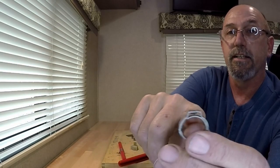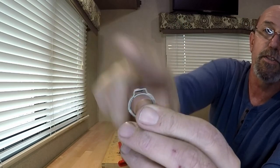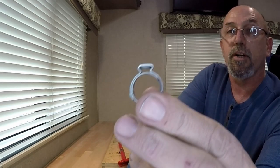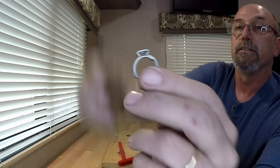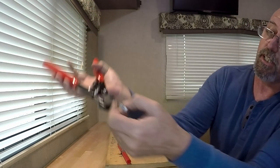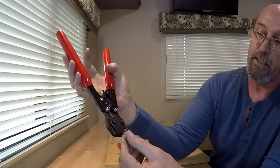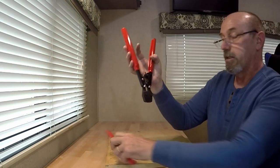Let's take a look at how this clamp is designed versus the other. This is where the jaws bite down on it — see how it's almost straight up and down. Whereas this one already has what looks like a partial crimp to it, and that's what allowed the jaws to lock that clamp in place and still be able to put it over the pipe.